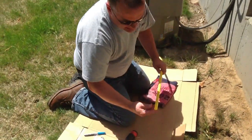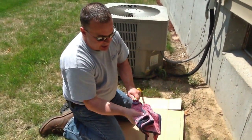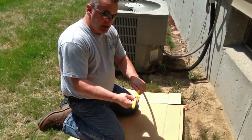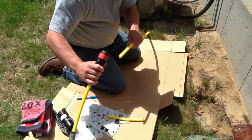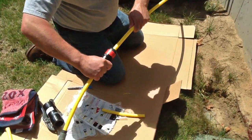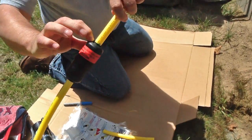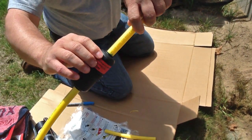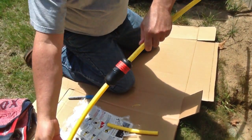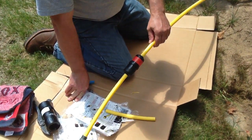So we've cut the tube, we've marked it, and we're just going to take a rag real quick and wipe it so that we're clean. Now it's as easy as stabbing it in. The stiffener is inside — we're going to get it lined up over the stiffener and then simply push it in, and that's it. You'll notice the mark is right on the end of that riser coupling, so it's fully engaged. At that point it's safe — we can now pick up the riser, set it in the ditch, and begin the bury process.